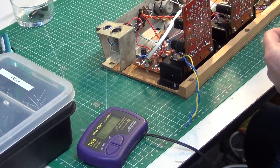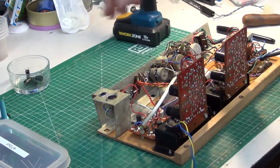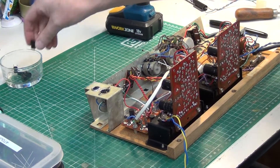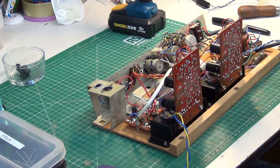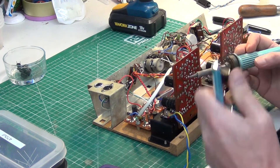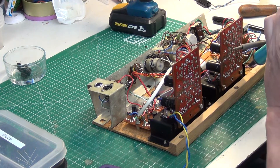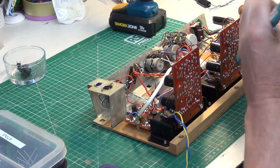These 8 microfarad ones seem to be pretty okay, but we can see some splits. There are two 100 microfarad ones I've taken out, and one of them reads 235 microfarads — that's always indicative that it's not good. We'll be changing these for Nichicons where possible. Eight microfarads is back from the valve days, so these days we're replacing those with ten.